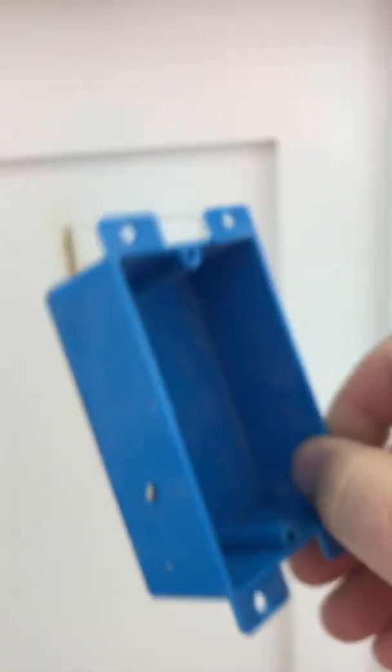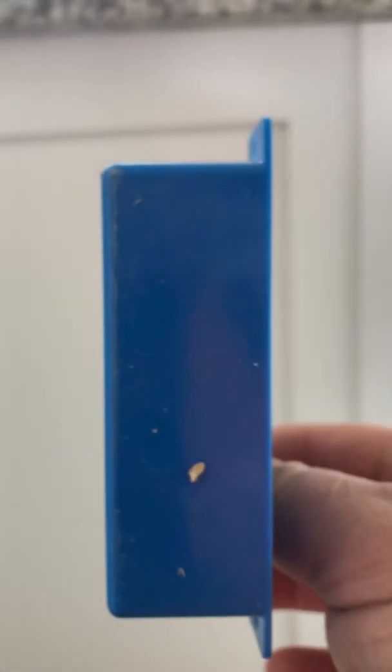I've already gotten started on this — I've already gone down two sides. This box is a cabinet box; they sell these at all the hardware stores and Home Depot. I like to use this one because when there are drawers in the island, they're small enough to fit. Remember, you don't want the GFI in this box — they don't fit. You want to come off of the last one on the counter.